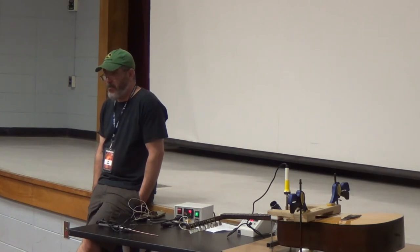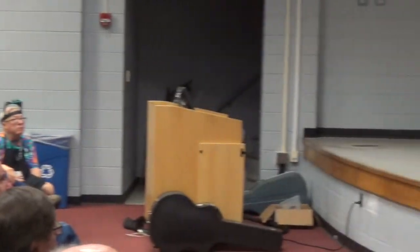Are these fretboards usually glued to the top too? Yeah, so this one I've pre-released the fingerboard extension on. And how do you do that? I used aluminum foil and I used a light to apply heat to it, and then palette knives and all that kind of stuff. What kind of light? An infrared heat lamp, like 250 watts, something like that.